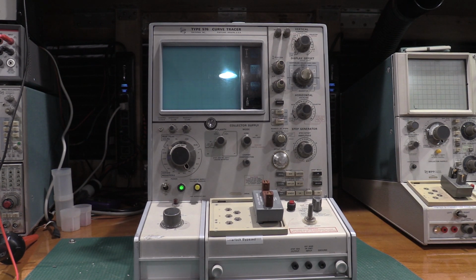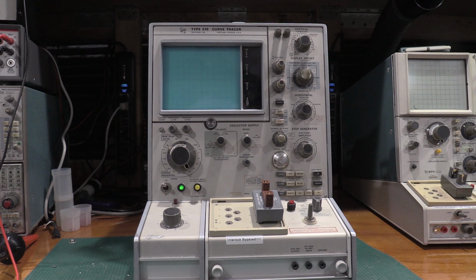It's actually dropped. It was drawing 59 watts before the rebuild. It's now drawing 49 in the same configuration, so we dropped 10 watts of standby power, so definitely we were leaking something through the power supply, so that's been rectified, so that's good. I just gotta put the side panels on and let this cook for a while, make sure the power supply doesn't have any problems. Once I do that, we will give this thing a calibration.